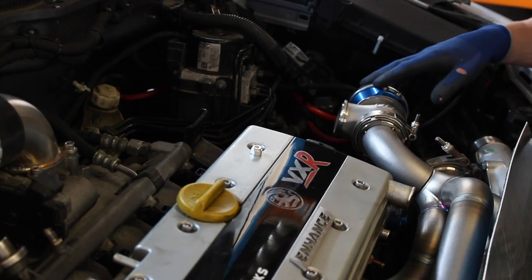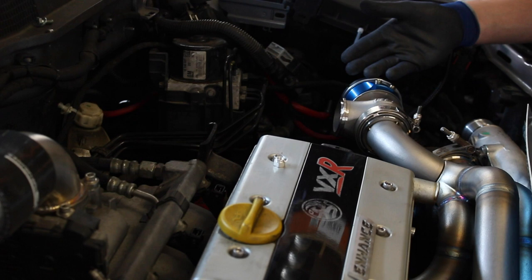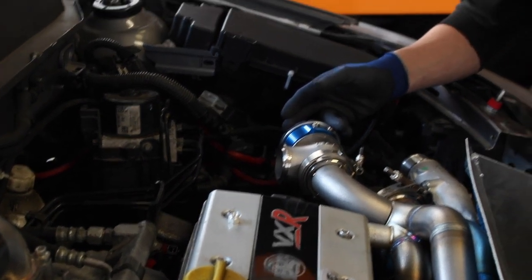We don't want to heat the inlet manifold up. We'll obviously have some heat protection - probably going to have the downpipe coated, or ceramic wrapped, or something like that. We're going to have some kind of heat shield, not exactly sure what yet, but there'll be something. For now we're just going to go with trying to keep it bang in the middle of both because they're both equally as important. We can always move the brake line slightly, and we can fabricate heat shields around the inlet manifold - it's not going to be that much of a problem because we can vent some hot air out of the engine bay anyway.